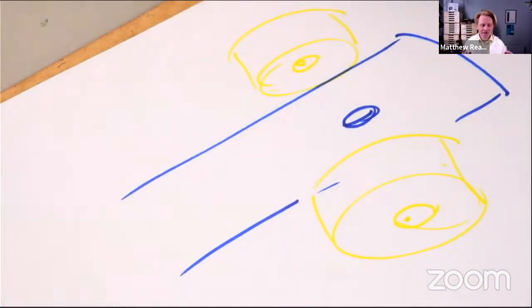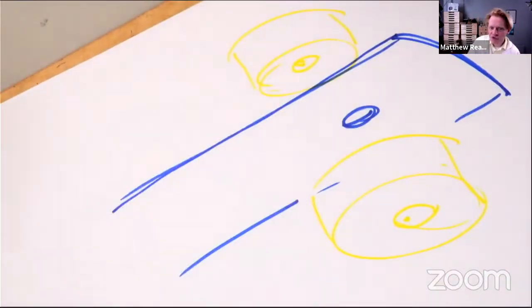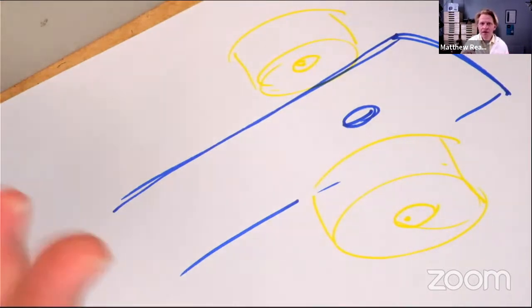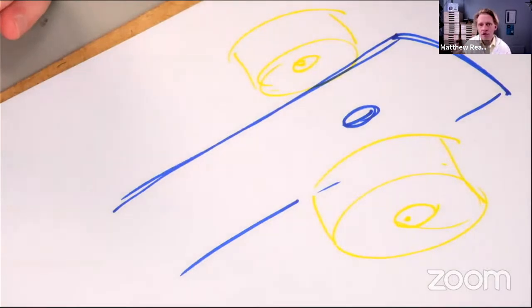What I think we established last week is that however you do the top block, make sure you didn't think that spring was only two-dimensional, heaven forbid. When we do the top block, it's got to be curved at the bottom. This is the top block of the suspension spring. Irrespective of how the back cock is shaped, don't be tempted to make the top block fit. It needs to be curved so the suspension spring and the pendulum can assume the vertical under the influence of gravity.